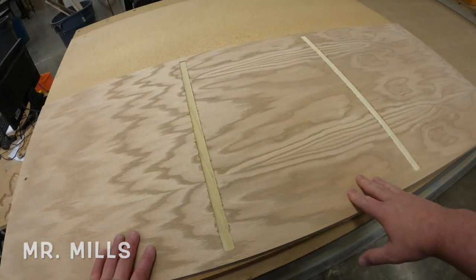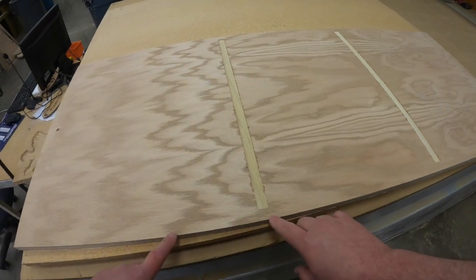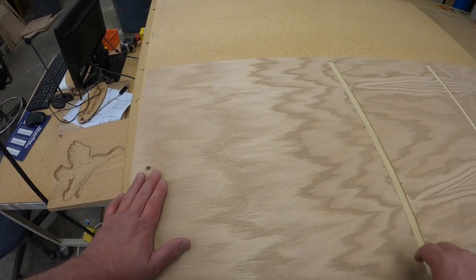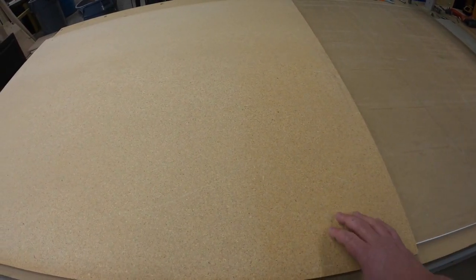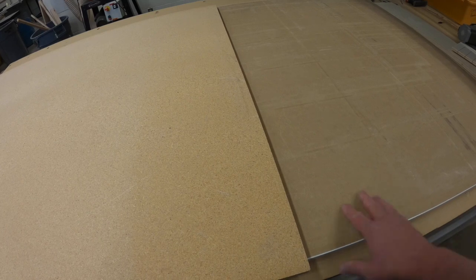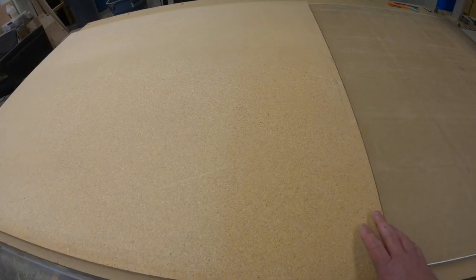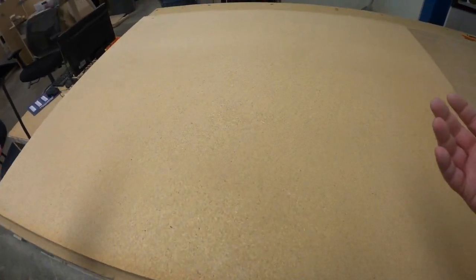This is the piece we want to cut on both sides. We've cut our first side out and left it big with a border all the way around. We have three-eighths inch holes for our index pins. I'm moving this off the table for now. What I have is a sacrificial piece of particle board on top of the typical spoil board. I'm going to drill the index pins into that particle board so when I align the piece and flip it over, it will be lined up in the right place.